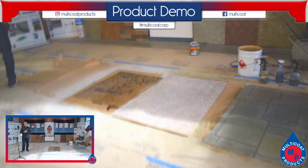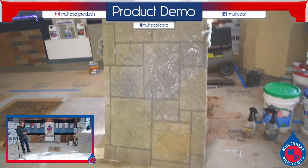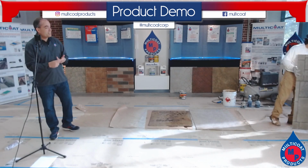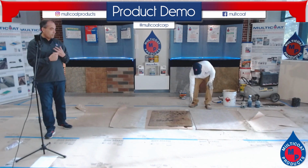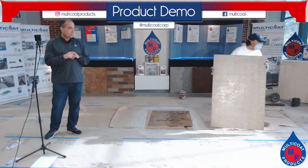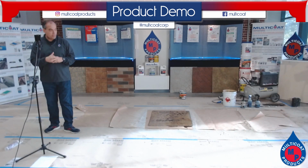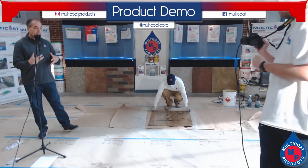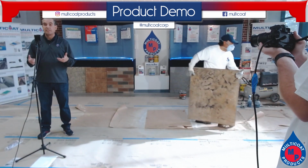Next, we're going to talk about our waterproofing. You've seen our stencils, you've seen our stamp, you've seen our creek coat. We've talked about microtopping. We talked about our sealers, our clear sealer for water-based, our solvent-based Seal Bright sealer, and we've talked a little bit about our multi-guard sealer. Again, anytime you're using any sealers or concrete coatings, we always recommend our vapor shield, like I showed you earlier, to block any hydrostatic pressure or efflorescence coming up and chalking up your sealer or your coatings.